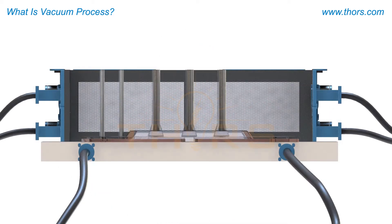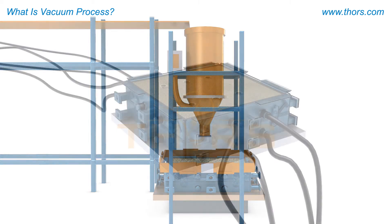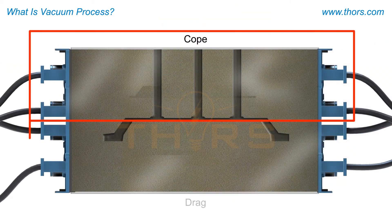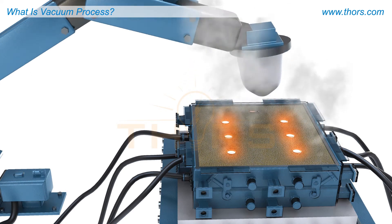The two mold halves are prepared by vacuum packing non-bonded sand around the pattern halves to create the mold. The prepared mold halves are lifted and transferred using overhead crane bearing systems to assemble the cope and the drag. The molds are indexed down the line and molten metal is poured into them.